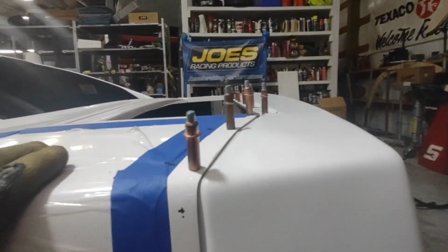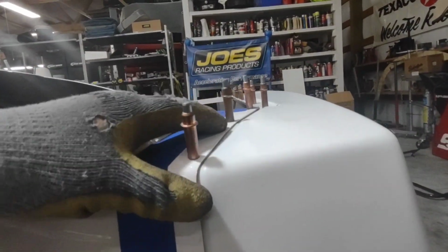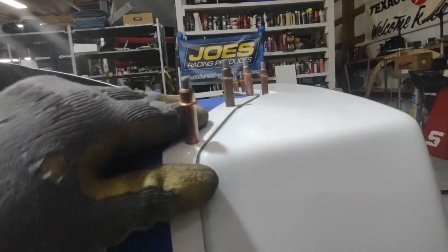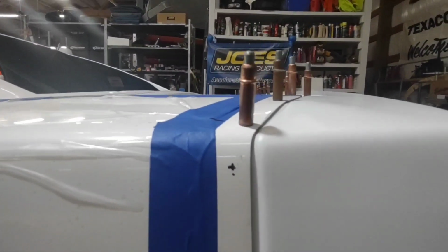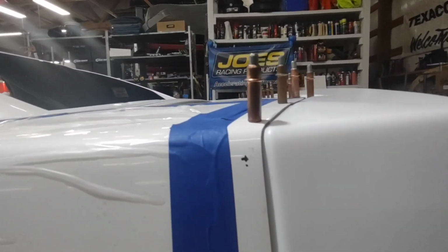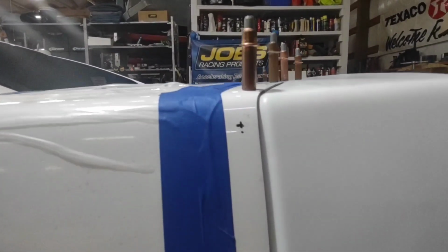You can see where that quarter panel dives off after it gets over that deck lid bar. Same thing. Put a jack stand under this corner and then just slide it forward till you get that spot smoothed out. Look how much better that is.